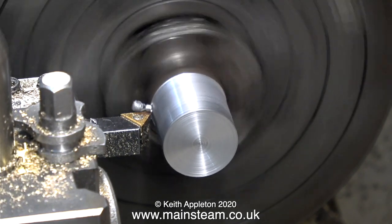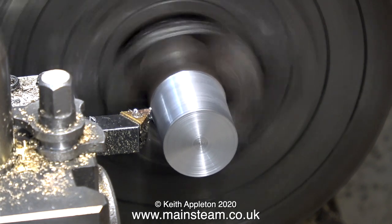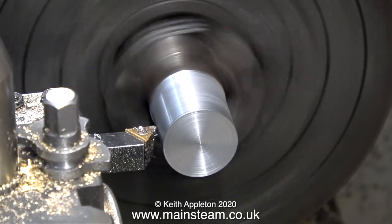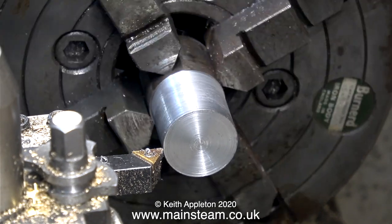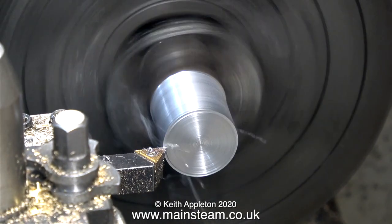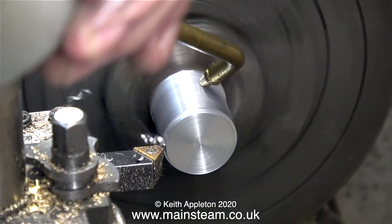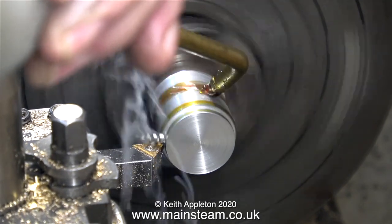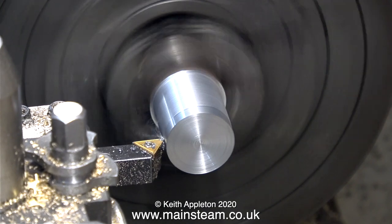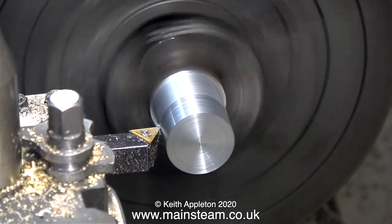It's time to turn it to a clean piece, but before I do that I'll take all the roughing cuts, because the finish at this stage is unimportant. When I need a nice finish I'll change the tip and try again. Applying some oil to the job always helps — this is steam oil. This clip shows the quality of the finish after I change the tip, and as you can see it's a lot more even and quite shiny.